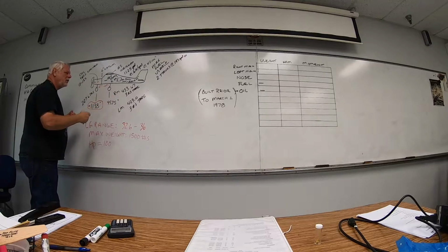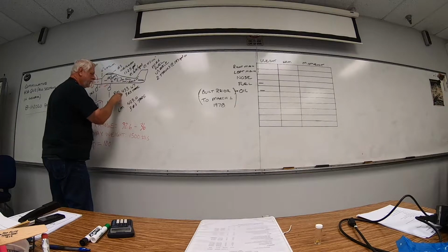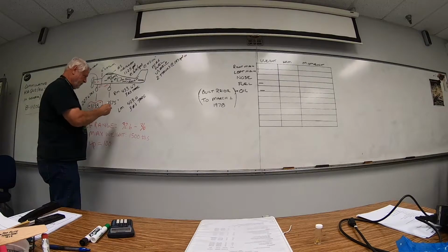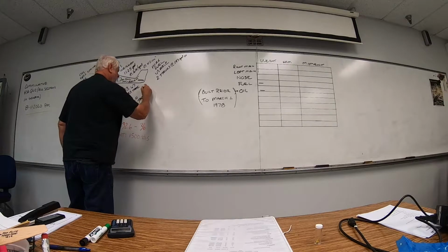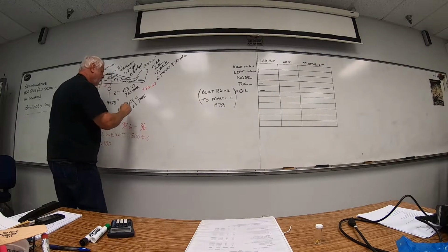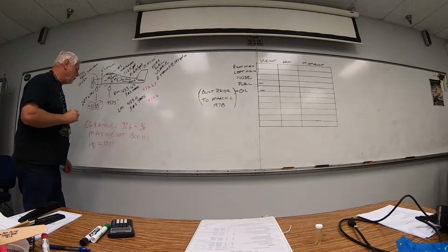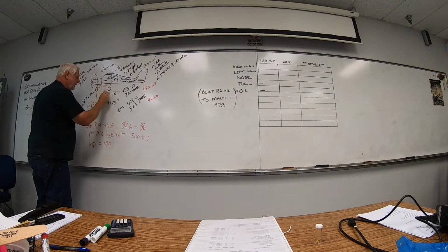So here are the actual numbers that we took off our scale. I did add some tare weight. I want to make sure everybody understands that the tare weight has to be subtracted out. So our right main, 3 pounds of tare, that's going to give us 430.67. No tare on the nose. Our left main was 423 with 3 pounds of tare, so that's going to be 420.0.